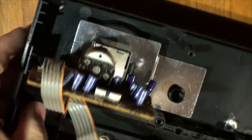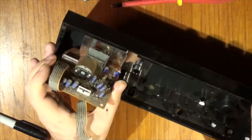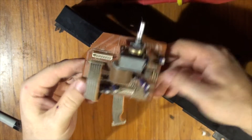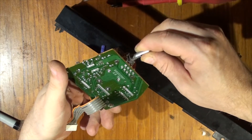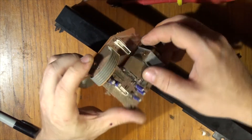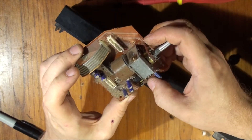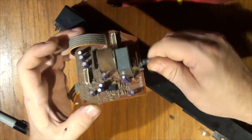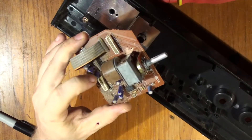I'm going to remove that motorized volume control — I think I've unscrewed it all. Very tight fit — there we go. Here's our motorized controller. As you can see, it's got a standard stereo pot, a little gearbox and a little motor that drives it, and there's the motor controller. And what is that? A KIA 4559 — you don't see those anymore in receivers.